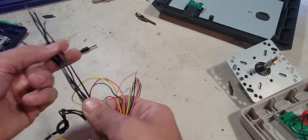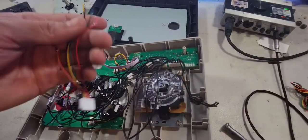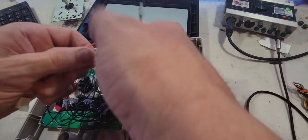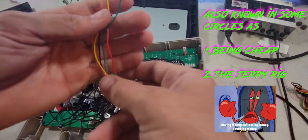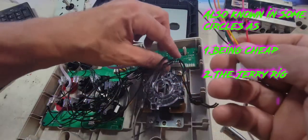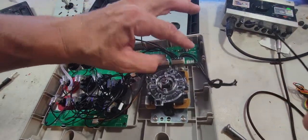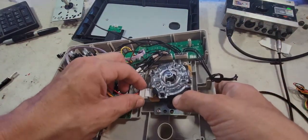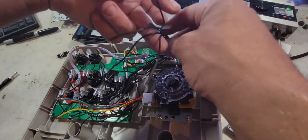Now make sure you trim that down — that's way too much cord, and we'll go over why. I cut it down to around five inches, a little shorter than a dollar bill. I like to take my scissors and use them as a wire stripper — if you take the scissor end like that and put it up against the wire and pull it, boom, it turns into a wire stripper. You could also use a knife, a razor, or a wire stripper if you have one. You're going to take the five wires that you have now plugged in, after you plug in the controller input to the Sanwa adapter that came with it, and follow directions — this is how we use the harness.